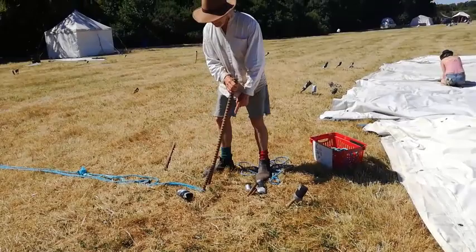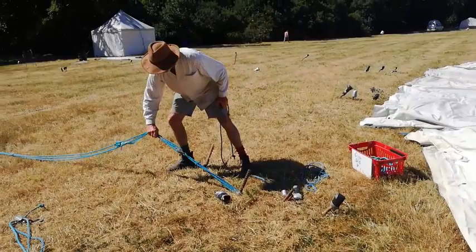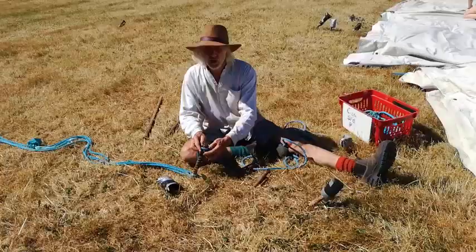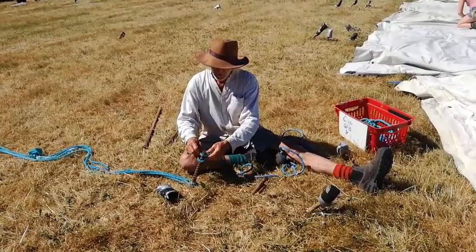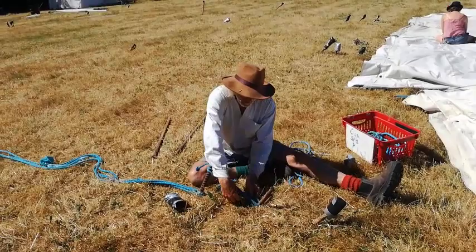Quite a mission. And this is what a dead man is. See the pulley system here. They'll be pulling off that onto this here. What I do here on the top is I do a clove hitch around, nice and tight, then do a clove hitch here again.